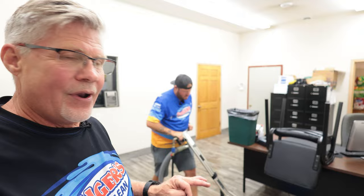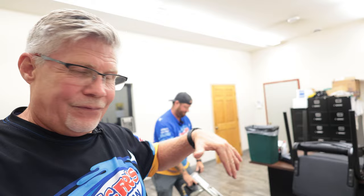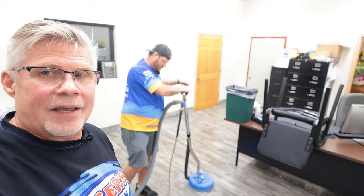Now, there can be some porcelain tile and grout issues out there too. The porcelain, there have been some issues, they are correcting that, we know now, but if you let it dry, it'll meld into this fake finish they put on them. Not good. So it's nothing in the formula of the super sealer, but even our Tsunami, any cleaner can sometimes create a problem on porcelain with a high pH. This is porcelain. We're not going to have a problem because we're keeping it good and wet.